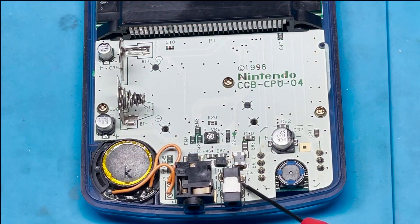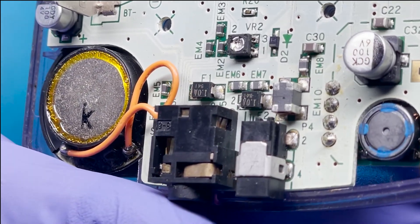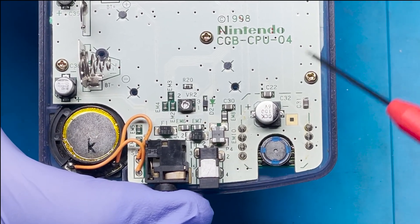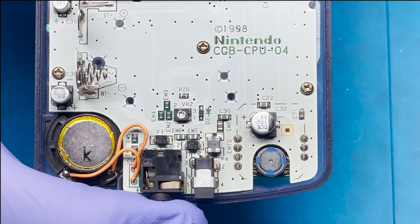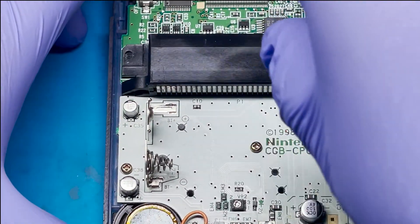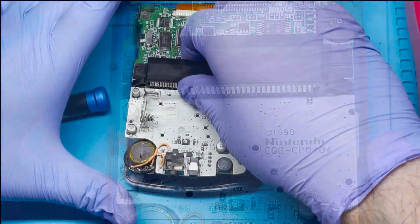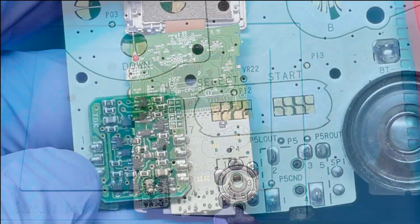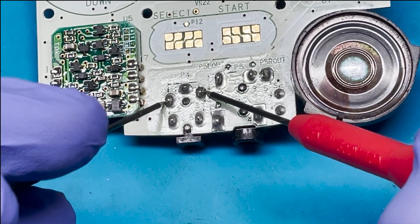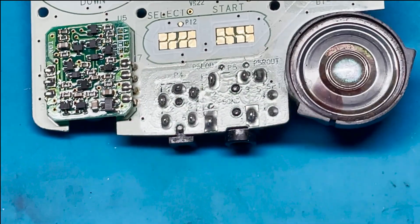I don't know if this is particularly the issue. One of the things that may have happened — it doesn't really look corroded, maybe it is, but it looks okay. I'm probably going to have to go ahead and reflow this right here, and I might have to remove some of these screws to get to the other side of the board and make sure everything's being reflowed properly. As far as I can tell it looks really clean — let me check the bottom side. Yeah, still not getting anything. Let's get the soldering iron turned on and go ahead and reflow this.